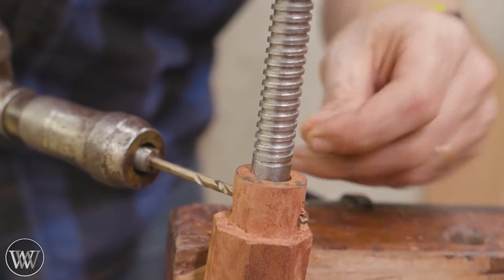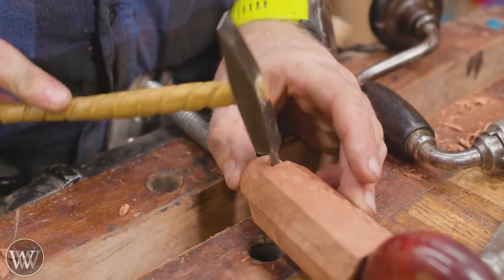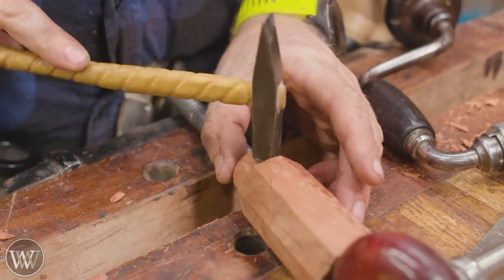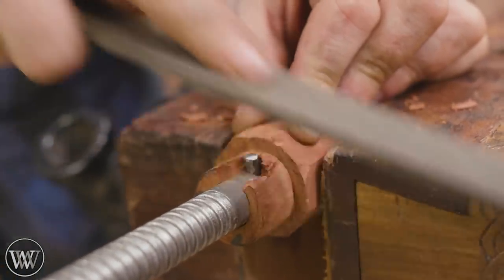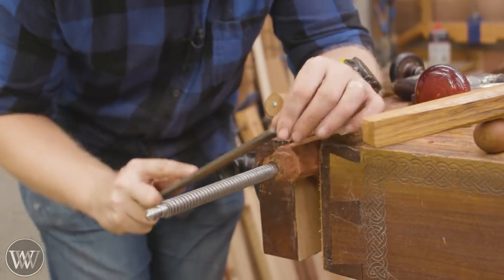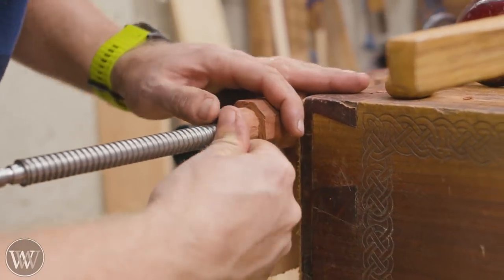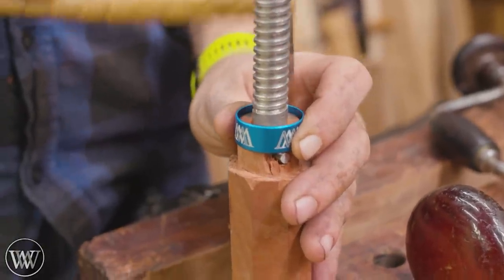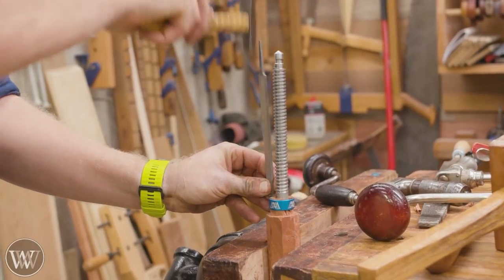Unfortunately I didn't think about it enough — when I pounded the pin down I blew out the other side on one of them. I should have kept the clamp on there to prevent that blowout, and as you can see, a chunk is missing. Now I need to file off the pin so the collar can fit down over it. I got it really nice and tight, had to tap it down with a punch — I couldn't find my punches so I used an old trash file.